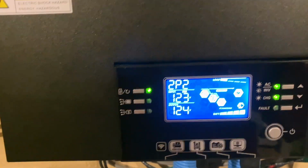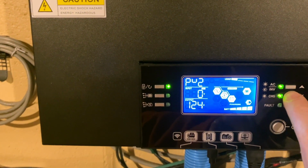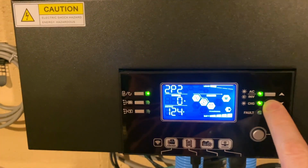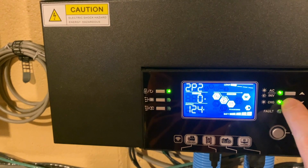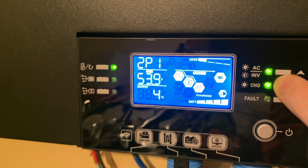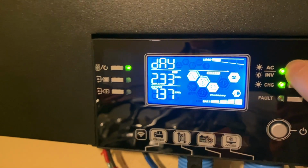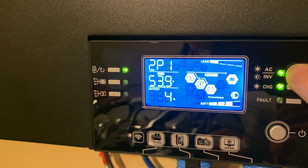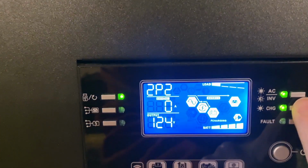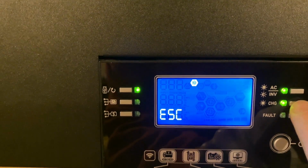Alright, so here's what's going on. I'm going to do this on the phase 2 inverters since it's easier to do this on one. So right now, no power is being put in from the phase 2 inverter. Battery voltage 53.9 volts. Putting in 972 watts. And again, nothing from this one. So not quite 54 volts.